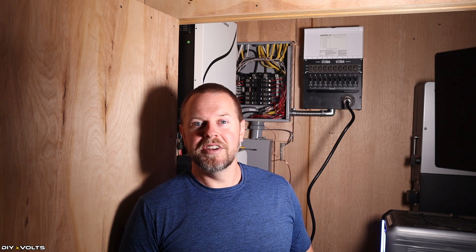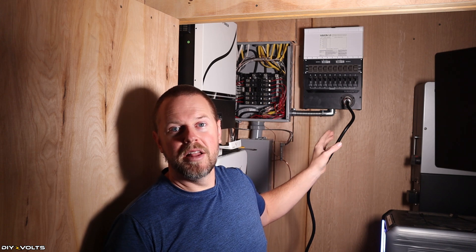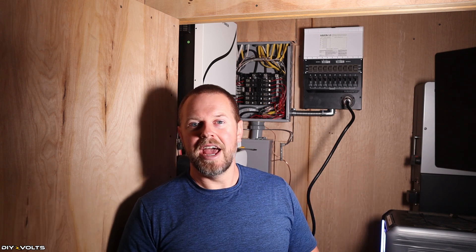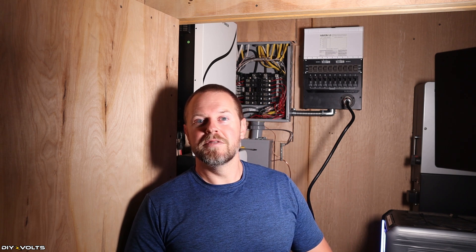The main things to consider: keep your red wires going to the breaker in your panel and the black wires connected to the loads going into your building. If you swap those up, you're going to have some problems. Other than that, it's pretty straightforward. If you've got questions or comments, write those down below. I'm Seth with the Do-It-Yourself Volts channel and I will see you in the next one.